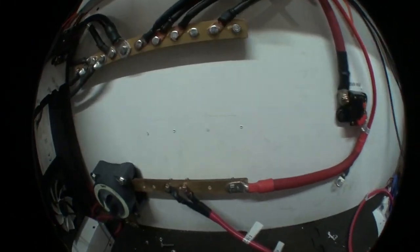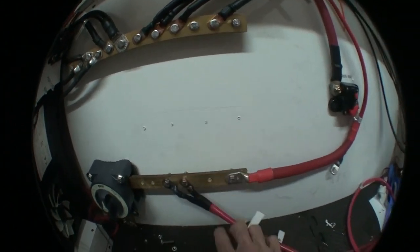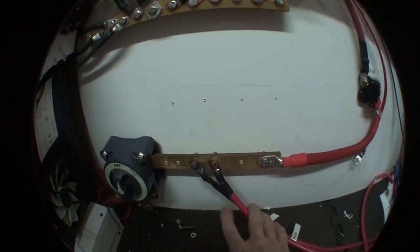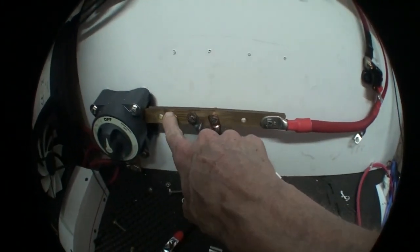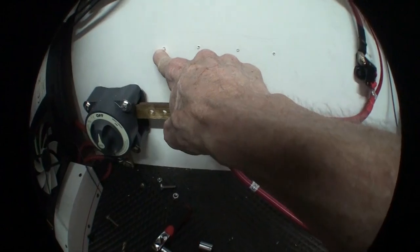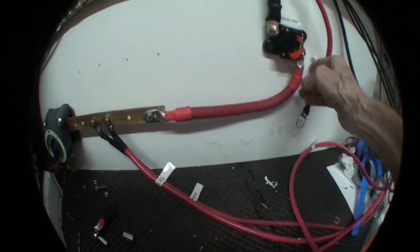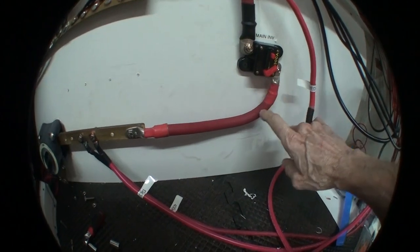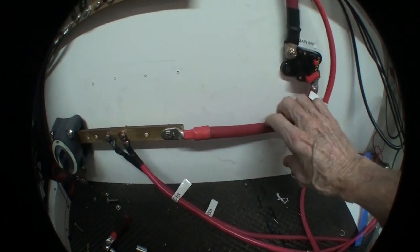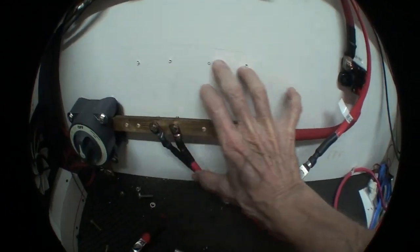The correct position for circuit breakers would be right here. I still have to disconnect these two. So from the bus bar, a short jumper to a circuit breaker — here I've got this one started: right from the bus bar, just a short jump to this circuit breaker, because none of this is protected.